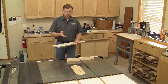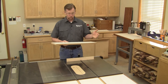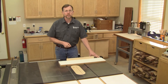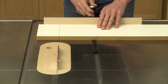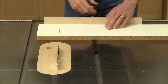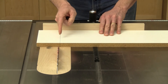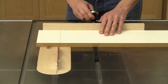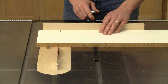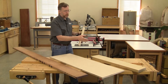The first reason has to do with bad friction against the saw table. Whenever you're using a miter gauge to cut work pieces of any size, all of this material is laying flat down on the saw table. As you push work pieces through the cut, you're having to hold them against the miter gauge and down against the table, and that just adds friction. If you don't have a good grip, they can actually slip out of alignment with the blade, and that affects your accuracy — particularly if the work piece has a rough or slippery surface like this melamine. And the problem just gets worse as work pieces get longer, wider, and heavier.